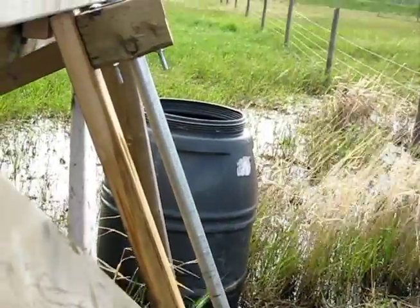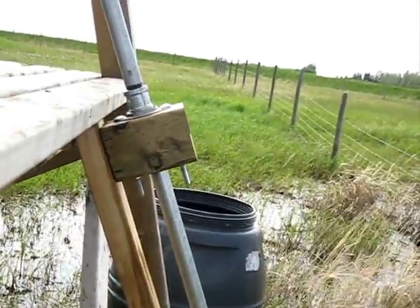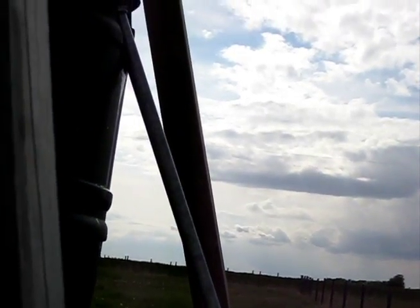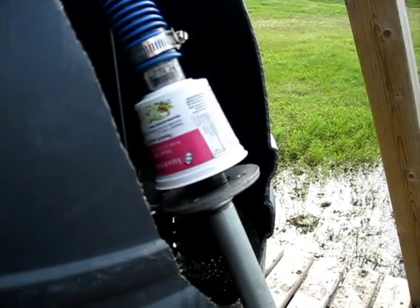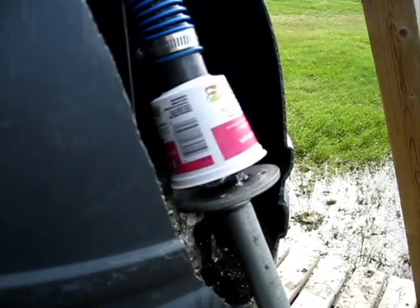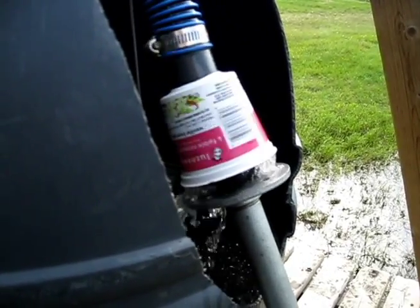The final section of galvanized pipe is mounted to the tower with bearings at each end. This section leads to the air-water separator. Since the inside diameter of the flexible link is small, the water from each wrap is followed by the air from the top of the wrap, thereby almost doubling the total possible lift height.